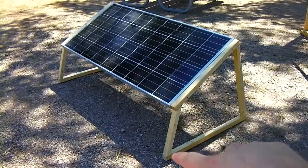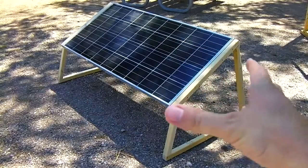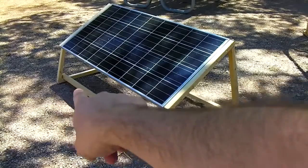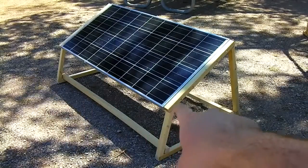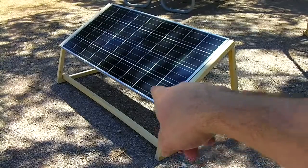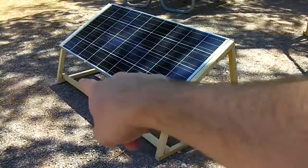It's looking pretty good. Now we're going to add some crossbars onto this thing to keep it all together. Okay, there we are. A couple 59-inch crossbars added on the bottom here. And all you do is, measure from the wood you're attaching to the sides of the panel, one end to the other, and that will give you the width of your crossbars here.